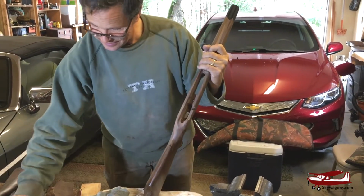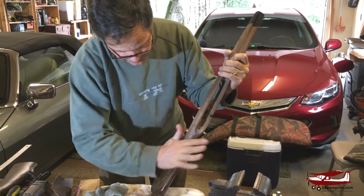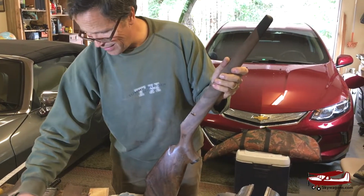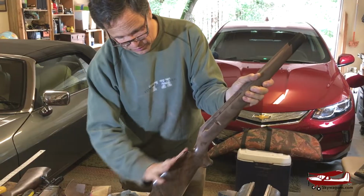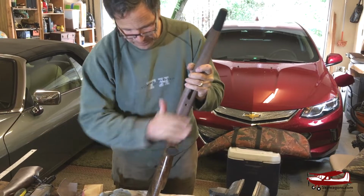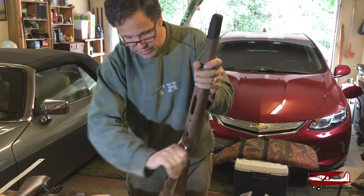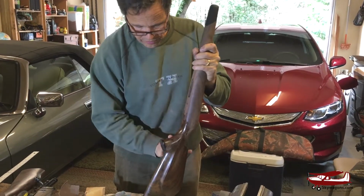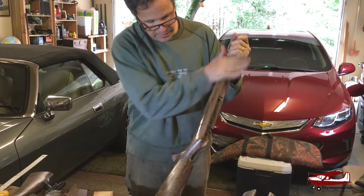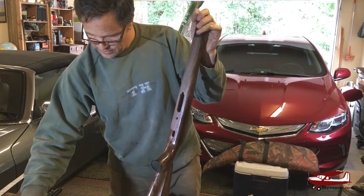And I do this, you won't see it on the video, but I do this a lot. You just keep doing it until it's dead flat after you've sanded it. And the sanding will go 400 grit, 500 grit, and then I go to steel wool and polish it, and you'll start seeing defects. And the moment you see defects, you've got to keep doing it, and keep filling, and you just keep doing it until there are no defects. And every time it becomes smoother and shinier, more and more defects will appear. Unless you are really good. So this isn't like an oil or anything, it's literally just packing it into the grain.